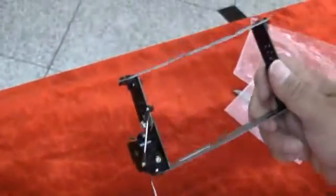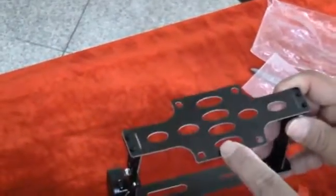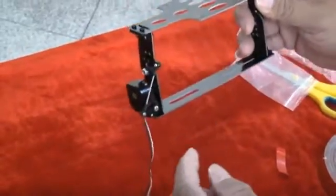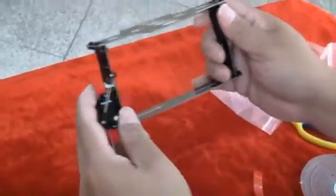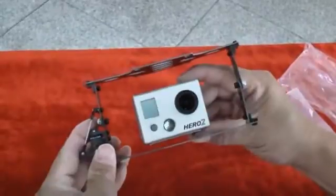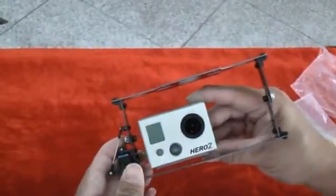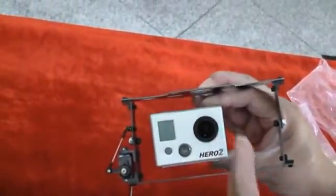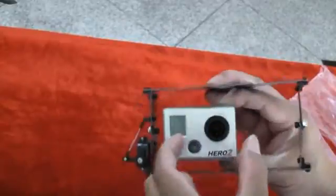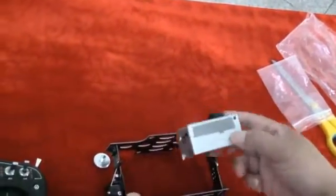Let me show you a little bit about the mount first. The top portion is where you have the square plate. The bottom portion, the skinnier part, is where you mount the Hero. The motorized side should be on your left hand when looking at it from the front. When you mount the Hero camera, you want the lens right in the center of the mount — not the camera body, the lens — because it's so wide angle, you want it mounted right in the middle.